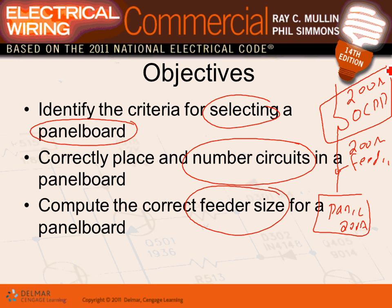Now for voltage drop, Adam, for voltage drop and carrying capacity, I'm going to have a 300 amp feeder because of voltage drop, feeding a 400 amp panel. Okay? Look what happened. I have a conductor worth of 300 and a panel worth of 400 protected by a 200 amp circuit breaker. This is legit, but this is what I call a poor man's design. Bad idea. You really don't want to do that for the most part.